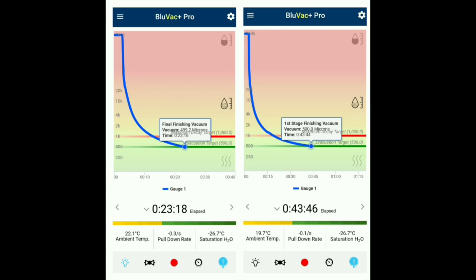But all I need to see is that the true blue hose was almost half the time of the quarter inch hose. It just kills the idea that the connection size is the difference — it's the hose size, guys. So that is the 2 CFM battery-powered vacuum pump by NAVAC, the true blue hoses, and the Blue Vac Plus professional micron gauge. Thoroughly impressed with the setup guys. Happy HVACing.